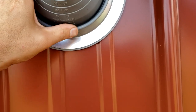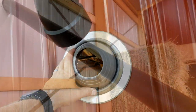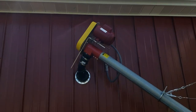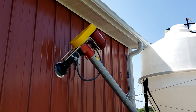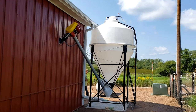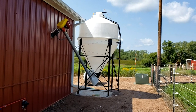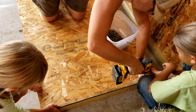Once I got the wiring in place, I had to secure up the barn so it doesn't get water in. Everybody does this differently — I chose to use a roofing boot. I went to Menards, bought a roofing boot, and shoved a three-inch sewer pipe PVC through it. At the top I used a sewer pipe expansion clamp and hose clamped it on. This is pretty much how it looks right now — it augers right up to the right height, drops the feed down into the chute, which goes into the feed bucket on the other side, where the family can scoop out of it.